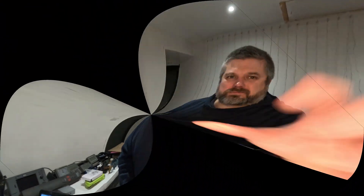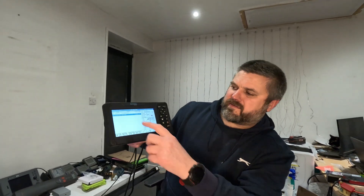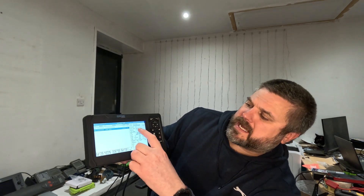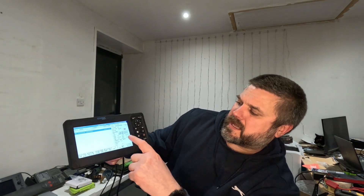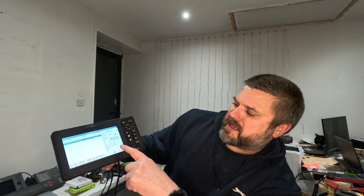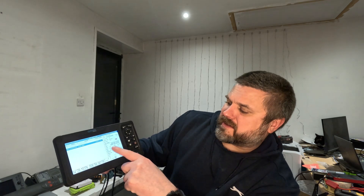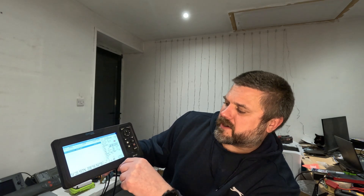The problem was I had used mixed case for 'Freebird' — capital F and such. I'll go back and fix that. After trying again, there we have it: 'Freebird' showing up now with the MMSI, boat type, and the length and beam. It adds them up just as expected — eight meters by four meters — and gives course over ground, speed over ground, and all the rest, and starts beeping if the two vessels are going to collide.